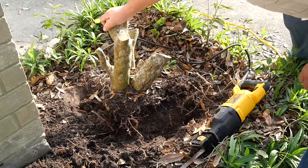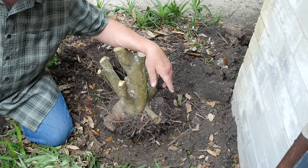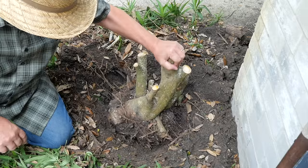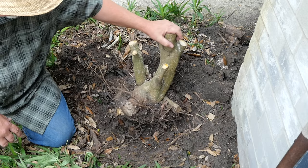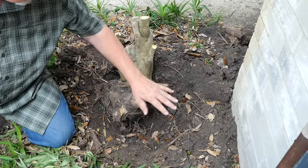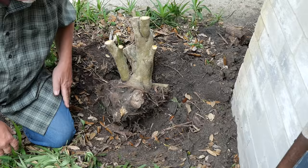I've got to let my machine cool off. You can see we've got a little bit of movement there, but it's still rooted in. It's the next day — I had to give up, I was a little tired. We had our contractor come by, but I managed to get this out. Check that out. This root was huge — it was giving me some trouble. But once I got the trench dug around my root ball, I was able to go in with a saw underneath and eventually pop this out. That's a heavy root ball right there. Now what we'll do is come in here and remove some dirt, and use the saw to cut all the rest of these little roots. If I cut them into sections, they're easier to work with and pull out. We'll do some criss-cross patterns with our saw and remove this soil down to the required depth — I'd say three or four inches.